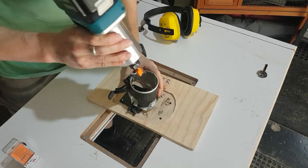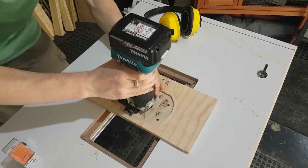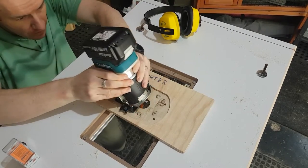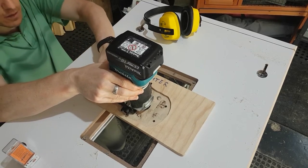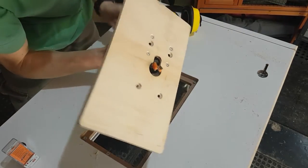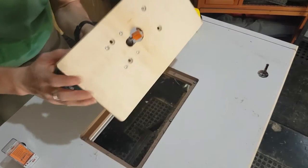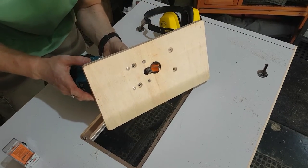To install you actually have to have it at 90 degrees or you can't lock it. Wind the router in, lock that down — that's that. Yeah, that's pretty good. Now you'll see what's going to happen up top here: this is going to be my 45-degree bevel cut, and I want to bring it up just a little bit so we can start running some boards.